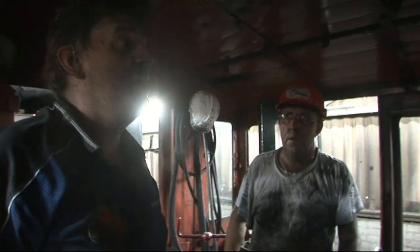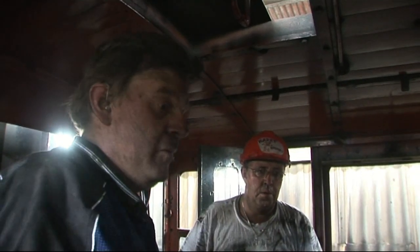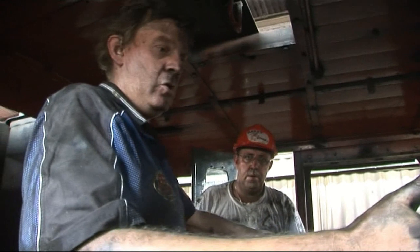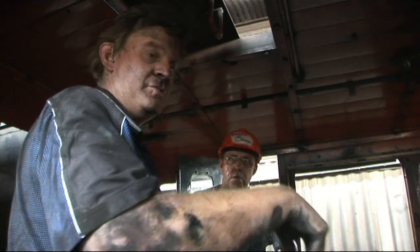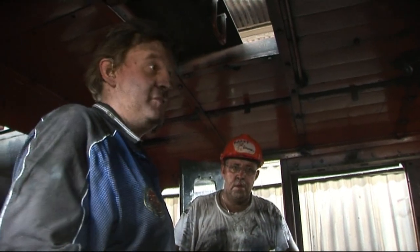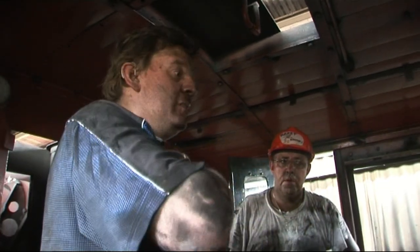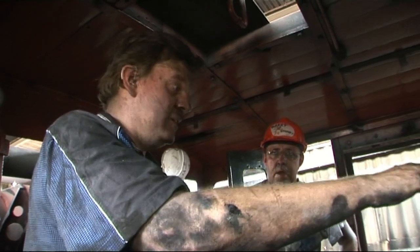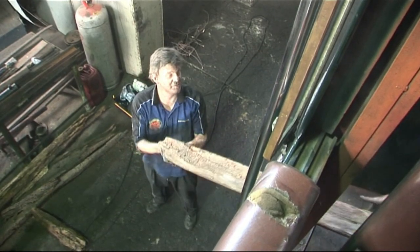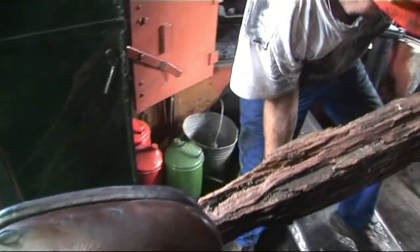Because we're going to light this boiler and heat it up over six to eight hours, we're not going to cover the entire grate. We're going to aim for a horseshoe fire — approximately half the grate towards the front — so the coal must be burning on the side but there's enough oxygen to burn the wood. If you're trying for a very fast fire, which is not good for the boiler, you cover the entire grate with a thin layer and put your draft on. But that stresses the boiler because you're putting a lot of heat at the tube plate.